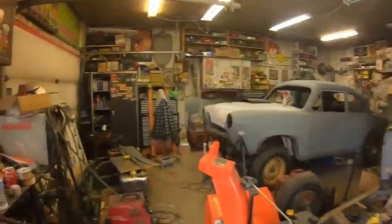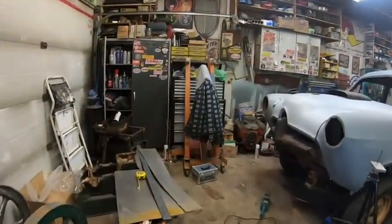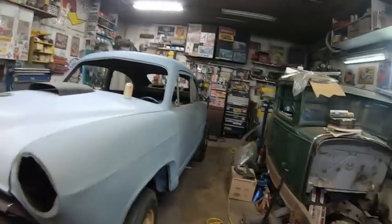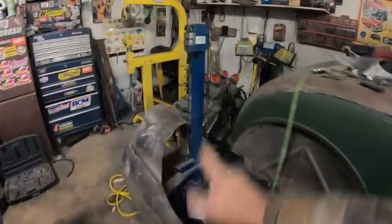So anyway, we'll go back in a nice warm garage and I'll deburr that guy, and then we'll try to put a 45 on the brake there, and we'll use the shrinker and stretcher to stretch it out to fit the contour of this guy. So we'll fit that, and like I said, then I'll knock off the rest of this paint here.